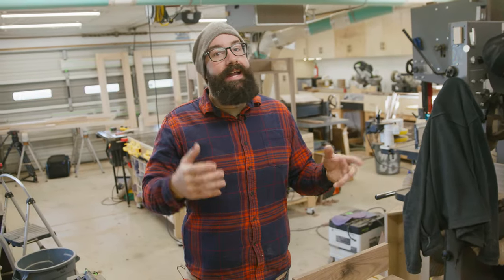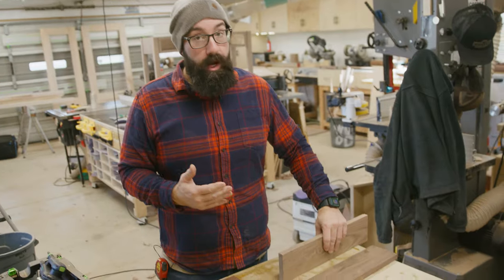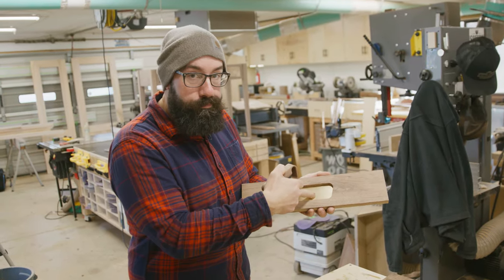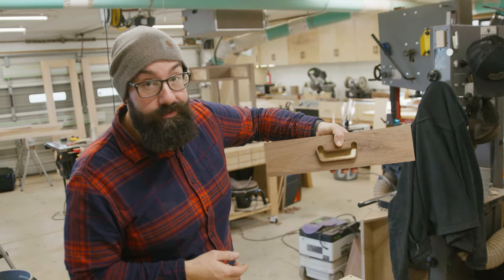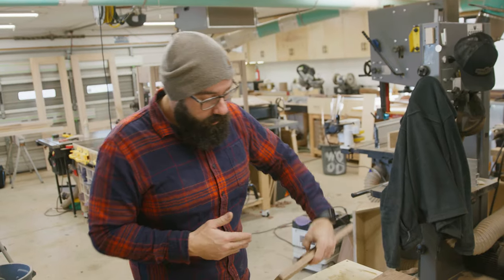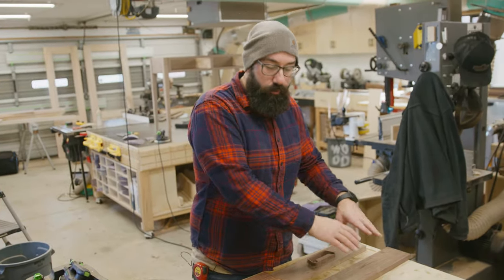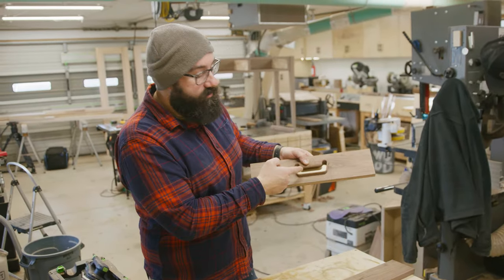Between day two and three I had an epiphany because I've been working with a lot of brass. I wanted to include brass in this build, so what I mocked up to show you is this: I put a pocket that fits this piece in, and I also put a piece of brass plate behind it, and this will go over it and get all glued in — that's going to be what our drawer fronts look like. I think that looks sick. I also took two new pieces of black walnut that were grain matched, following down the same board, so this is less distracting — with these two pieces almost looking like one piece, all attention will be focused on this drawer pull.